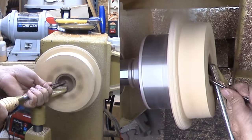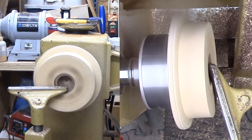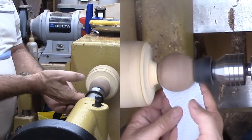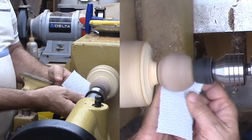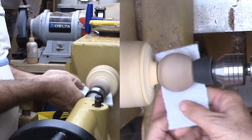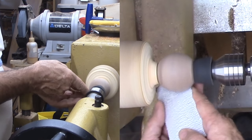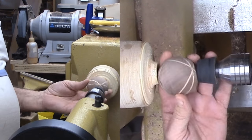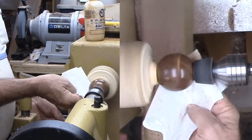Then I joined them back together. I glued one hemisphere to a piece of oak, let it dry, sanded the wood back to the edge, then glued it to the other hemisphere. I did not cut out the center of the slice of oak as the ornament was already pretty light. Instead of shear scraping, I went directly to sanding starting with 80 grit and moving up to 320 grit. The 80 grit took care of the last ridges from the slice of oak.